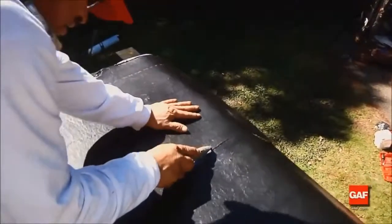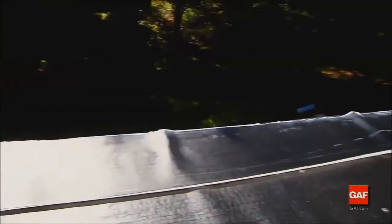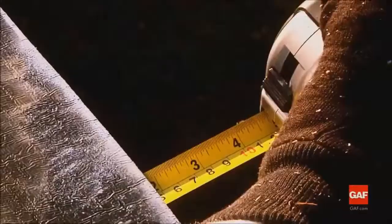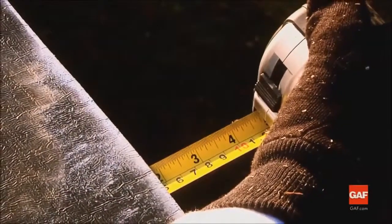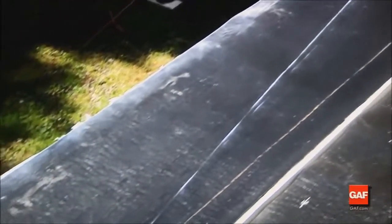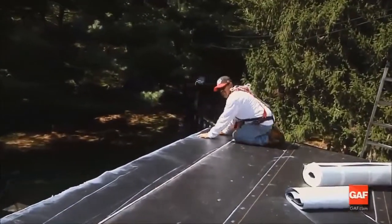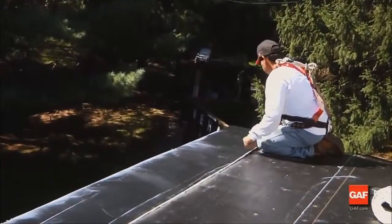Cut a 2/3 width of the Liberty base ply and align it with the edge of the roof, plus whatever is required to turn down on the fascia. This job has a 2-inch overhang turned down on the fascia. Position the selvage line on the high side of the roof to provide an overlap guideline and to assure that water flows over the side laps.